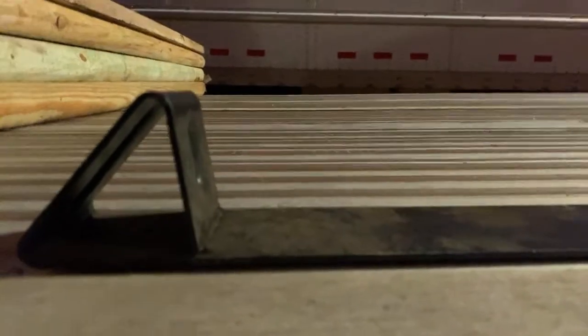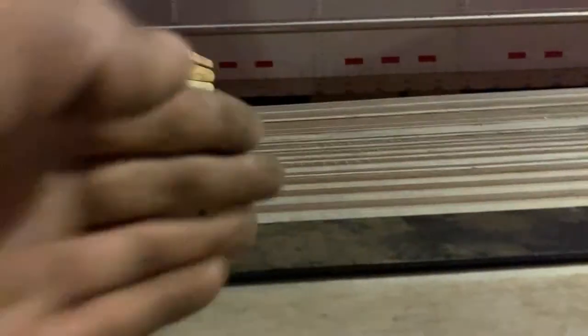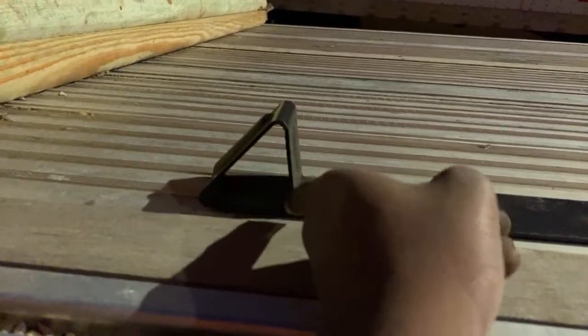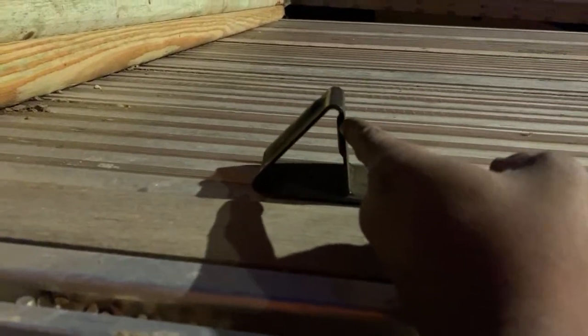Now, the only thing besides your chain that's keeping that core from jumping up out of there is a piece of 4-inch wood that comes out about right here. And if it's 90 degrees, it'll sit in that pocket, press against that, and this will press against the deck, and that will press against the deck also. When you bend this in, the height of this drops and gives it an easier way to jump across. Can you understand a 4-foot fence is easier to jump than a 6-foot fence? All right. So like I said, I don't want nobody to hurt themselves.